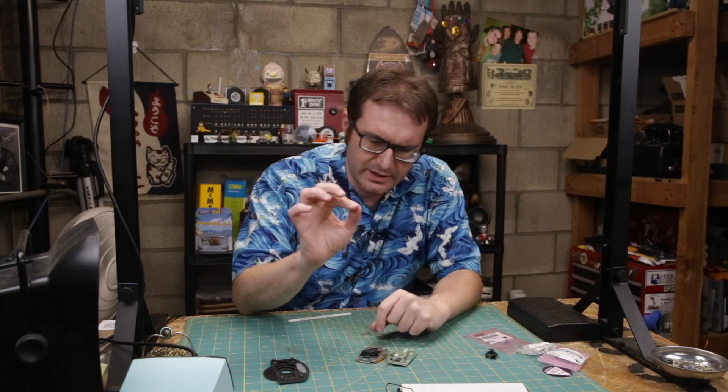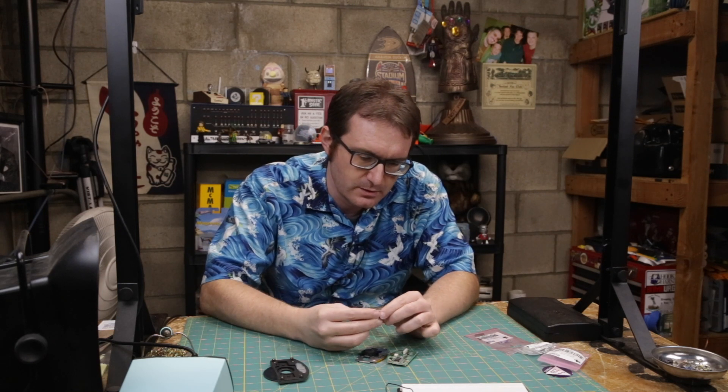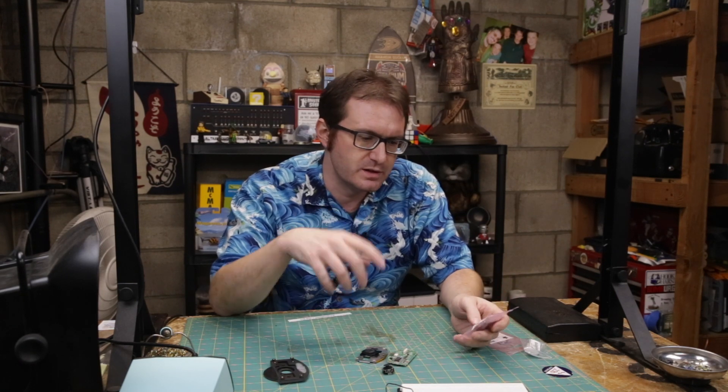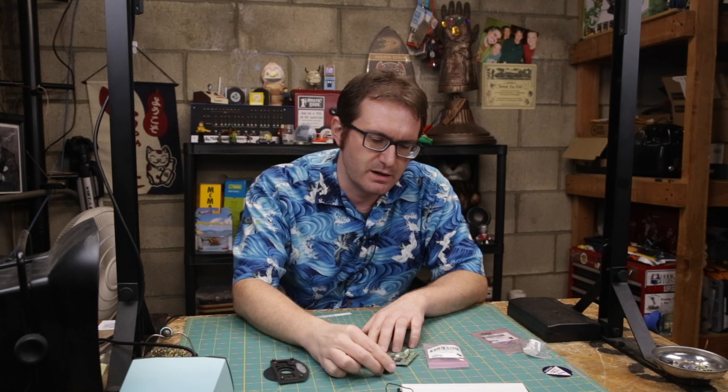So I'm going to wing it a little bit. Instead of using this, I'm going to use one of these little analog thumbstick controllers — one of these little joysticks from Adafruit. We're going to pair that with a 32U4 featherboard I've got left over from Project Quickshot, which was the NES Zapper. You can watch that video at element14.com/presents under Project Quickshot. It's still going to move the mouse across the screen based on displacement, just with a little better hardware, a little easier to work with, and a little less fidgety.